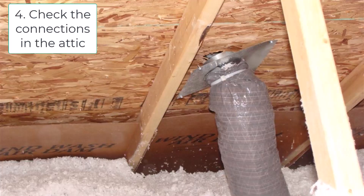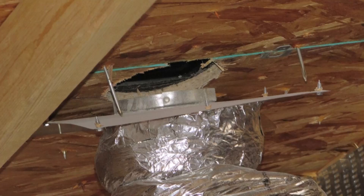It's also a good idea to get inside the attic and make sure that the ductwork is tightly connected and you don't have any gaps where cold air in the attic can dump back down into the ductwork. We see this happen on used houses and new houses. It happens all the time, especially after you have your roof covering replaced. A lot of the time roofers will put new nails in, the nails will knock something loose, and if your roofer isn't going back into your attic to check, it's a good idea for you to do it as the homeowner. Most roofers do not do this.